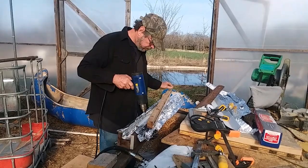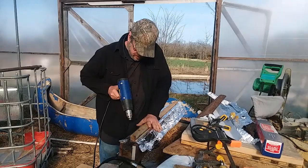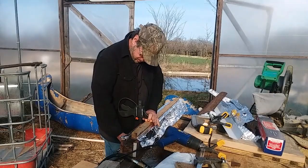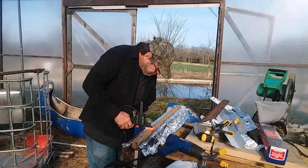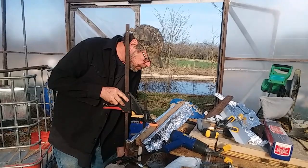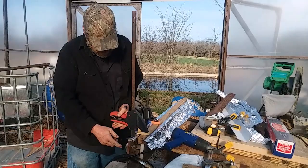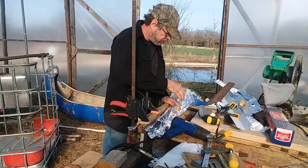Okay, it's about soft now — see how that's really hot — so I just put this on and clamp it down as quick as you can. It's a two-inch — I cut a two-by-four two inches and then put some one-by-three on the side, and that one-inch PVC flattens out to about two inches.